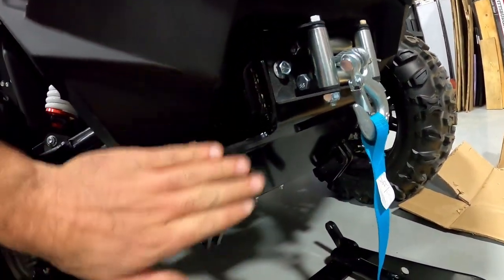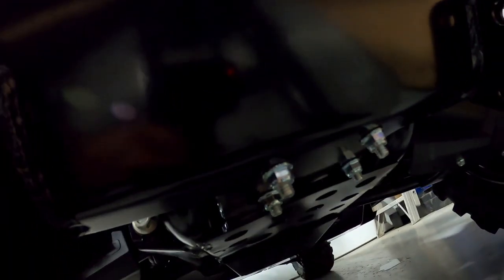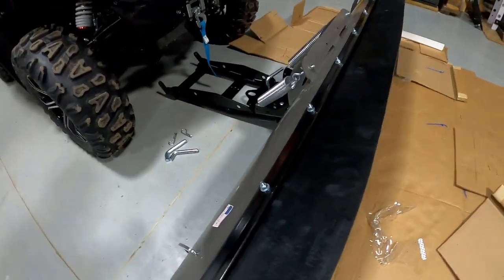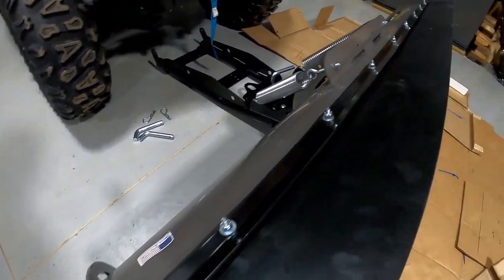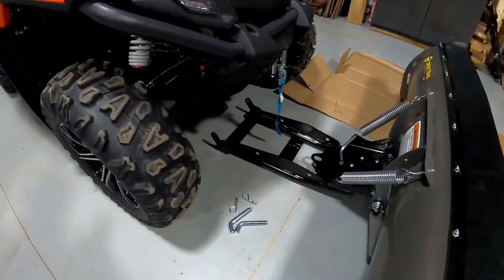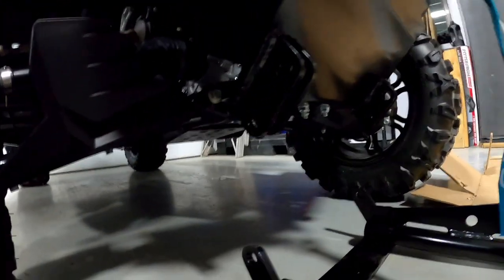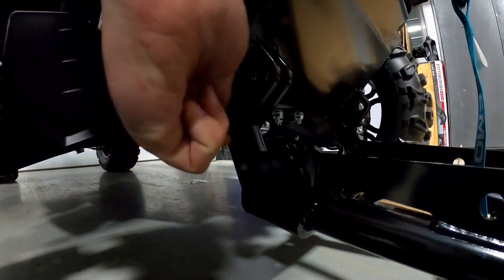That was pretty easy — we just pulled these two bolts out, slid this up, put it back in. It came with longer bolts because of the thickness of this metal. We didn't tighten them all the way so this can fluctuate and move around a little bit. We've got our two U-bolts installed on the bottom, tightened evenly. The mount is on the machine, the push tube is done, and I also installed the flap on top — it just has this metal bracket and carriage bolts that come up through the top. Now it's literally super simple: we're just going to pick this up, line it up — you might have to pull the machine forward or back a little bit. That side's in, and then we take our cotter pin, put it in, and do the same thing on the other side.